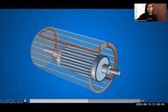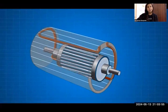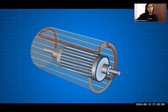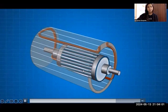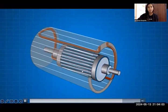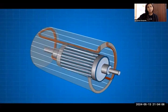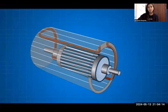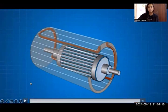Now, according to the Lorentz law, the electric and magnetic field will develop a force by which the rotor must rotate. However, that does not happen. The alternating magnetic field produced in the rotor does not make the rotor rotate, instead it vibrates in a fixed position.